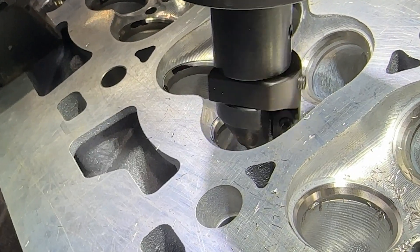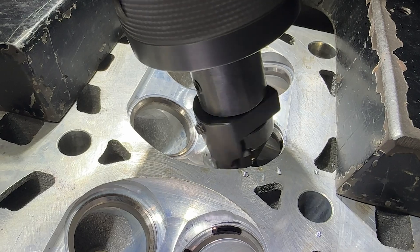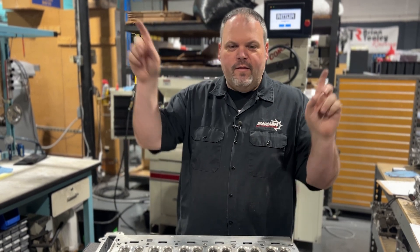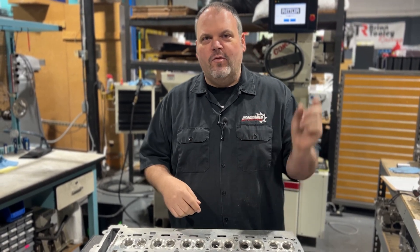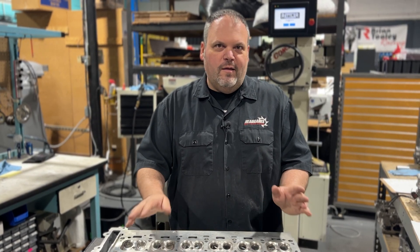This head is actually pretty decent when it comes to core shift. That's the thing you deal with on a cast cylinder head — the core actually shifts and it'll only CNC where the head should be, not actually where it is. We already had the valve job picked out for this thing. We showed the flowing before and after in a past episode, so check that out in the comments or description. This thing's ready for the valve job, and then we're going to show one more flow test, mill and assemble, and this thing's out of here — ready to make some power.